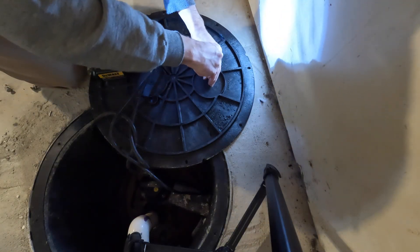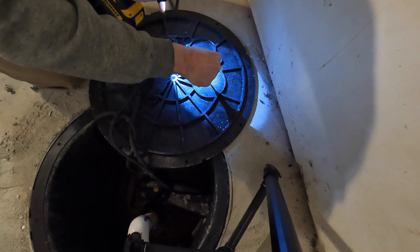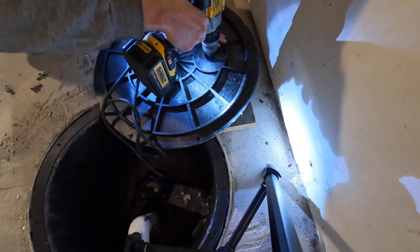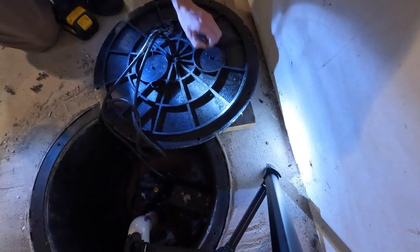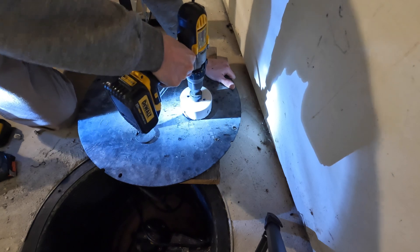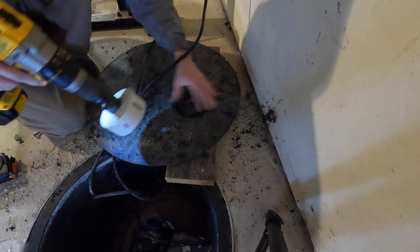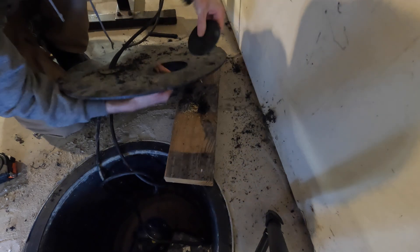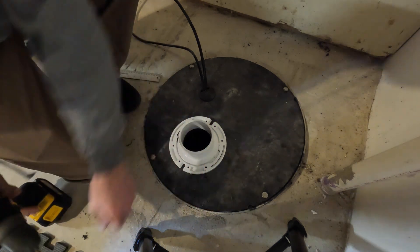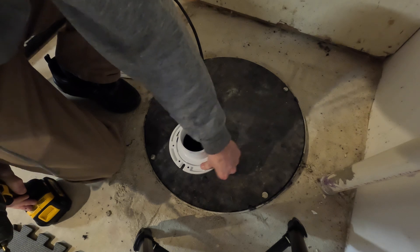To tap into the sump pit lid, I used a toilet flange flipped upside down. I drilled through the lid in a spot that made sense based on the rib pattern on the underside. Due to the size of my hole saws, I wanted to drill from the top to be as clean as possible, so I drilled a center hole up from the bottom first, and this worked out nicely. Then I drilled mounting holes for number 10 machine screws, which I used to bolt the flange down. I used some DAP 230 to seal the flange to the lid and seal around where the wires for the sump pump and float switch went through. I didn't seal the perimeter of the lid with caulk — I just used the rubber gasket that was already there.